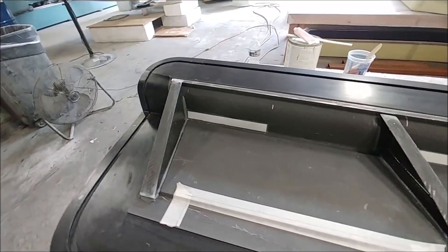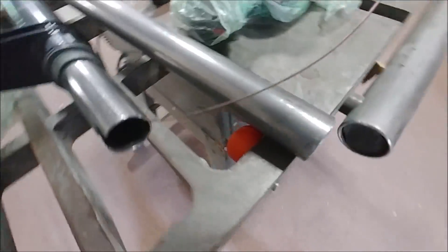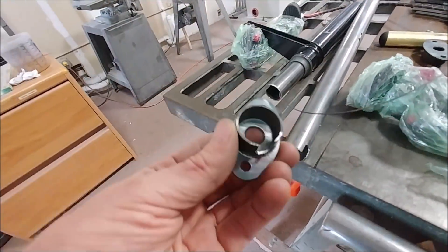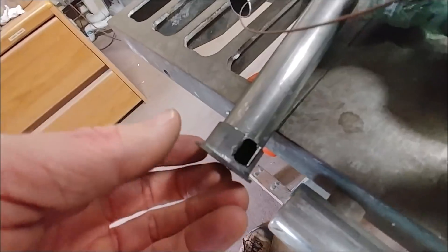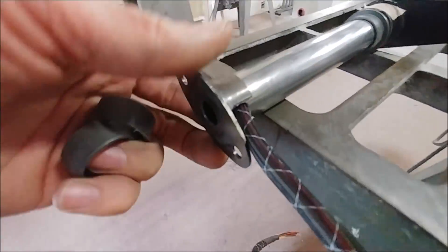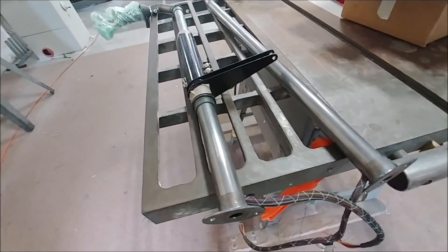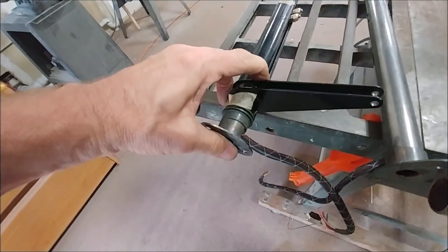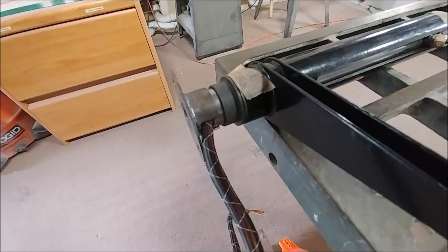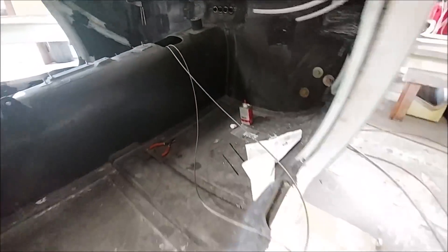Speaking of elevators, here are the side sticks — I've trimmed them to the right length and put a notch in the end. There's a little cap that goes on the end, secured with a match-drilled bolt, and the notch allows the wiring cables from the side sticks to come out of there. Then there's a little bearing that bolts onto that end piece and a connector that hooks it all up to the elevator torque tube. This allows the stick to pull all the way back with a bit of extra clearance so the wires won't get damaged.